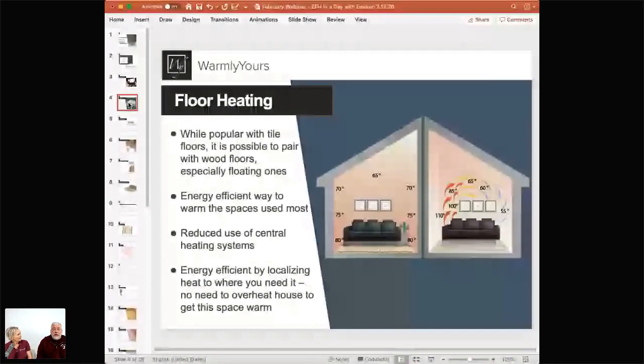What we're doing is heating from the floor. So you're not dealing with that vortex of hot, cool, cold air coming in from a furnace. There's no blowing wind, no dust, no allergens. On the left side you can see there's a nice even heat throughout the room. The most important thing is your toes are nice and warm. With forced air, your toes are getting the air after it's gone up to the top of the room, cooled off, and sunk back down to the bottom.